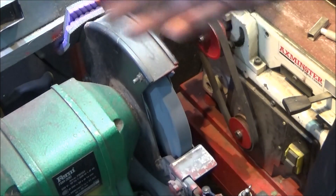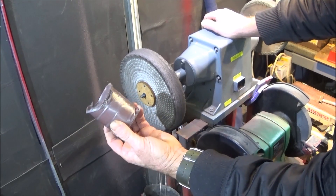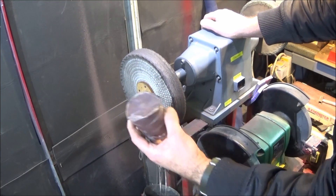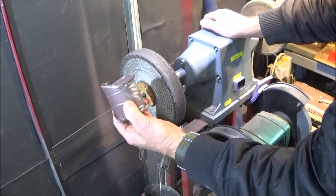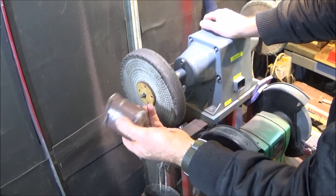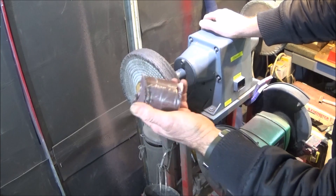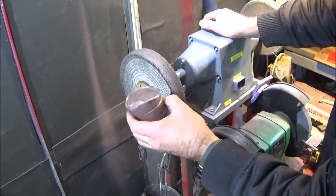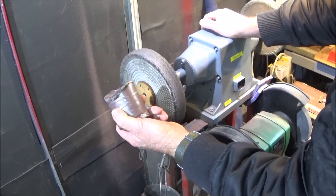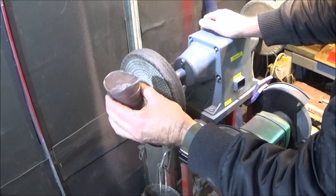Next I'm going to buff it up on the buffing wheel. I use a satin compound — it's 180 grit, you can get this on eBay. It's the best compound I've ever used on a buffing wheel because it's greaseless and water-based, and a block like this will last a long time. If you're ever soldering on copper or brass, you can clean up the brass on the buffing wheel with this and because it's greaseless you can go straight into soldering without having to clean it further. I'll put a link below where you can buy this — if you do, keep it in an airtight container after use and don't let it sit in hot sun or it'll melt.